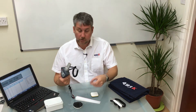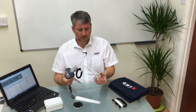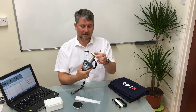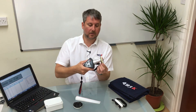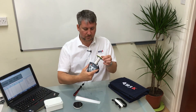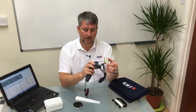We need to lift the magnet, which is a small cube magnet — so you don't lose this inside the mould, we attach it to the kite string and that can be used to thread it inside the part. The head is held up against the sample and the part can be tracked around. You can see that we use very powerful magnets so that even when we are some distance away from the part, the magnet does not lose contact. As you track the sensor around the face of the part, it will give you an on-display reading.